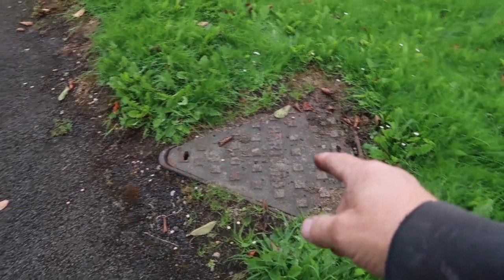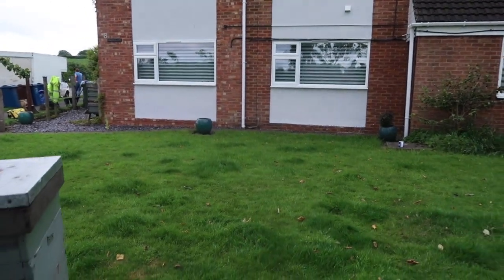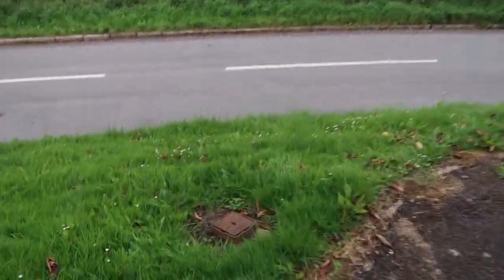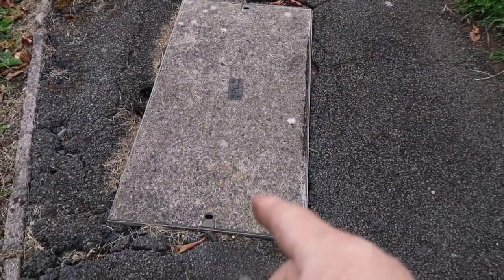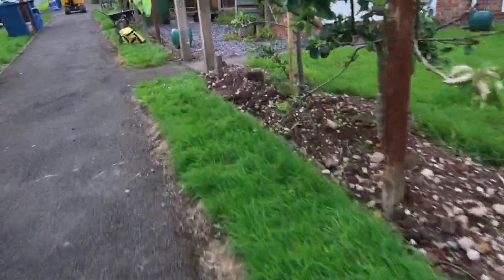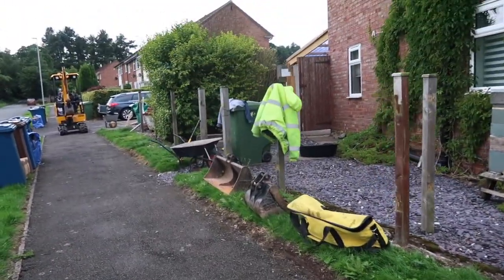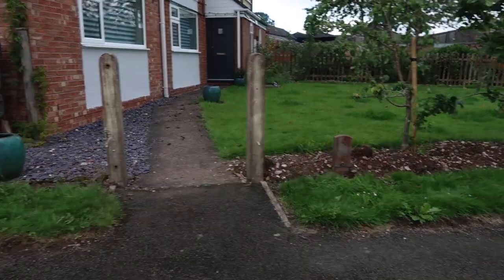Okay, we've got a drain here and it runs across where the wall's going. These are the issues. We've got the drains there and the drain there. Also, we've got water here. This needs to be looked at. We've got an electric point here which needs to be looked at, and that runs each side of it. As we showed earlier, we've got some kind of GPO, and a light here, where the power comes down here. So this is the project, quite a big wall right across.